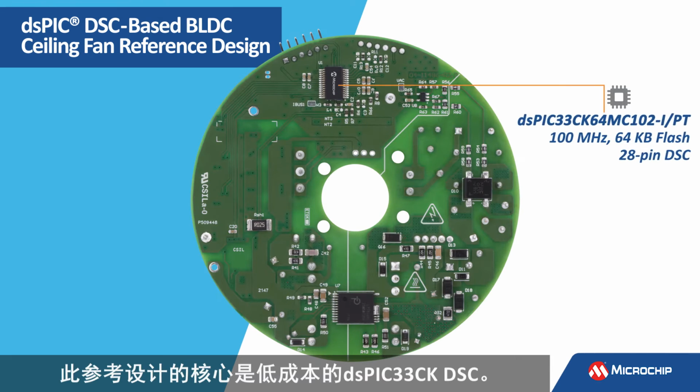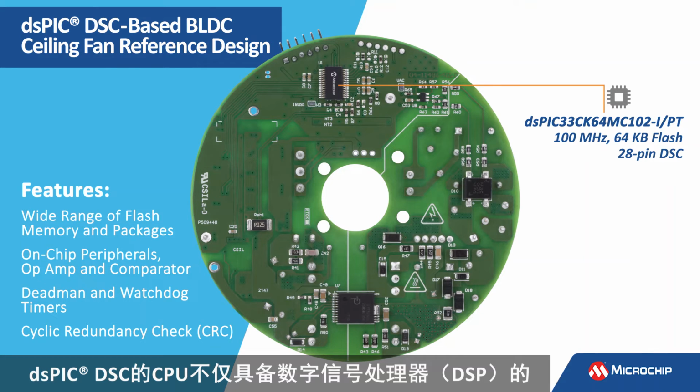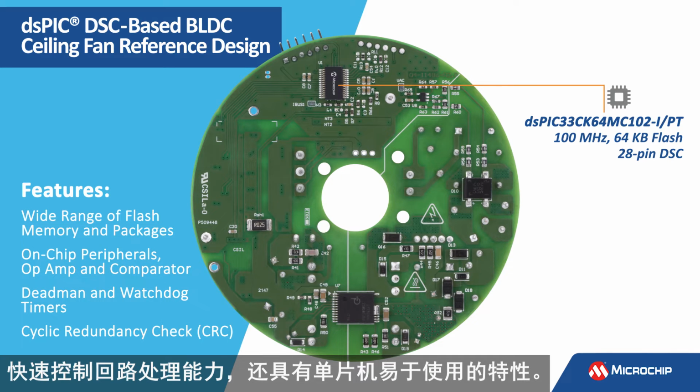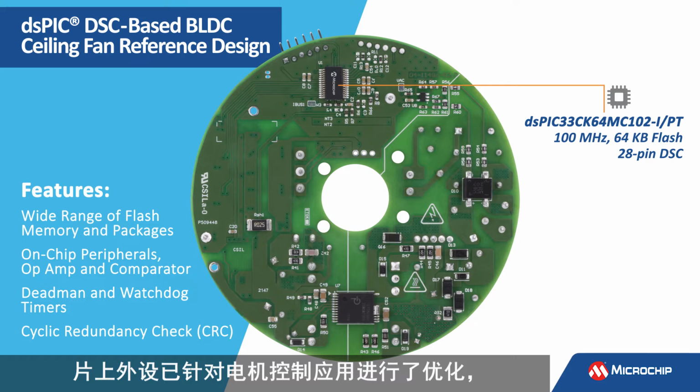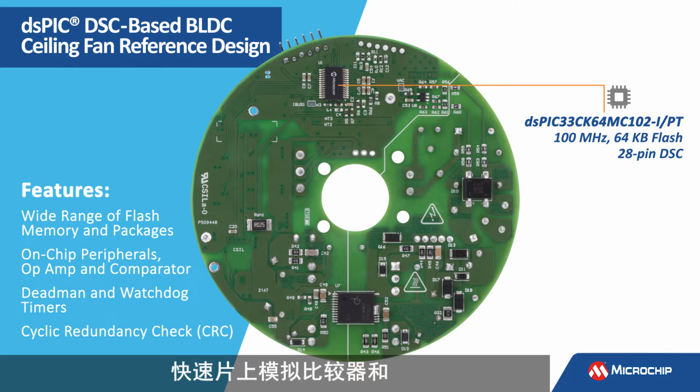The heart of this reference design is a low-cost dsPIC 33CK DSC. Devices in the dsPIC 33CK family are available in a wide range of flash memory and package sizes. The dsPIC DSC's hybrid CPU combines the fast control loop capabilities of a digital signal processor, also known as a DSP, with the easy-to-use features of a microcontroller, or MCU. The on-chip peripherals are optimized for motor control applications with high-resolution PWM outputs, high-accuracy ADCs, fast on-chip analog comparators, and integrated op-amps with very low voltage offsets.